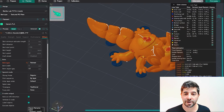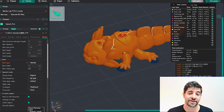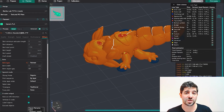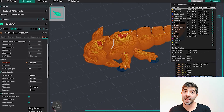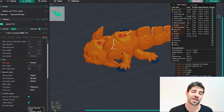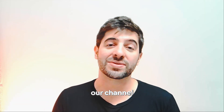Once you slice it, you'll see brim applied only to the specific parts of the model you selected. This is a big advantage on hard-to-print models — many models demand a little brim, but if you apply a full overall brim you'll spend hours removing it, and that's not what you want.